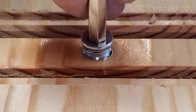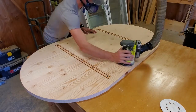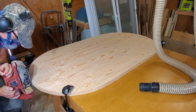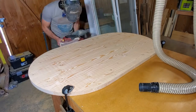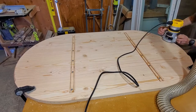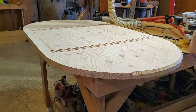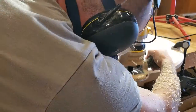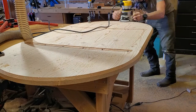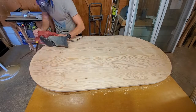Here's a great example of what I was talking about — you can see a little crack right there. I ended up using epoxy on the threads of those, so I'm not really concerned about any pull-out. Now I'm just going through and re-sanding the surface. I found this method a little crude but it ended up working really well. I knew I was going to come back through with the router — I put a 45-degree chamfer across the entire bottom of this table, so any imperfections with that sanding I would remove anyway. Then I planned to go back through and hand sand it. So just let me be me, no judges.